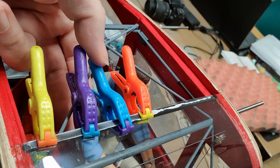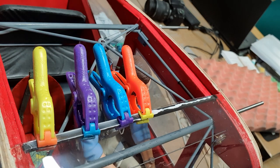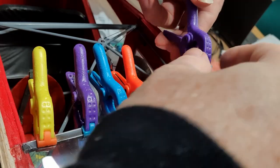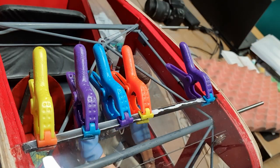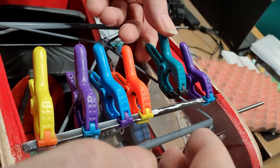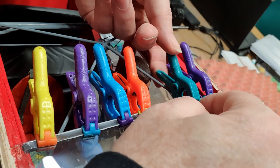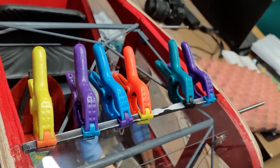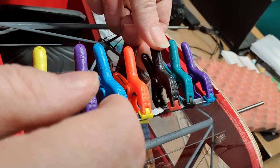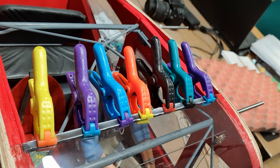Oops. You'd think with it being square section, it would be easier to get these to sit right, but it's not the case. But you can see it's squeezing the glue nicely. This will also help to remove the bow that we noticed when we relax the clamp. One more if it'll go. And I think if we give that until tomorrow to dry, we should be cooking with gas.